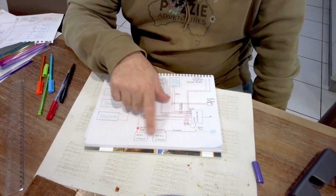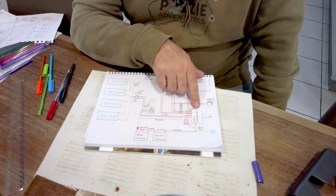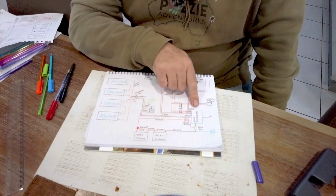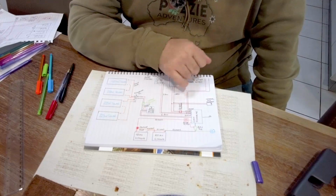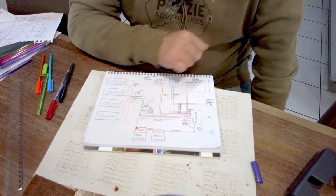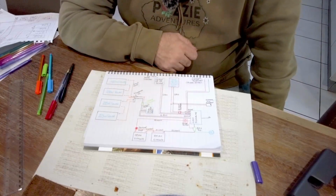So these are in the boxes at the side of the van. We're going to be running the power into the van under the bed, and I'll be building a board. Lynx distributor will be the center of that board, if you like. That's where the power's coming in. Okay, so where do we go from there? Well, that's obviously going through a power switch, so we'll be able to switch off the power at that board into the Lynx distributor, and then from there we're going to run the extras that we're putting in, as well as tap into what's currently on the van.